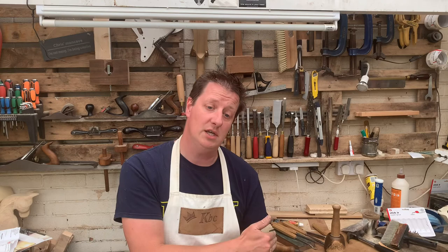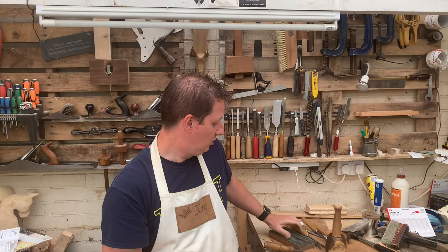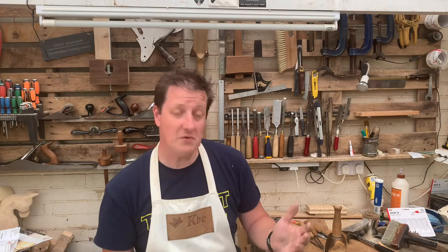Once you've got it to that standard, you shouldn't need to go back to any kind of belt sander ever again with the same tool. I wouldn't even want to go back to my sharpening papers — just keeping it honed on one of those strops sitting next to your work. You use it for a bit, go back and sharpen it, go back again, and it should stay that sharp forever just by using one of these. If you ever find that you've got a little nick, then we might go back to grinding a little bit off and polishing it up again, but that's going to be quite rare. Right — go and find a chunk of wood, sharpen your tools, and I'll see you soon.